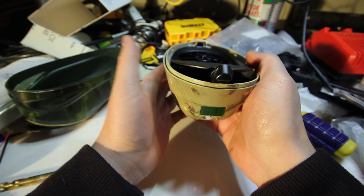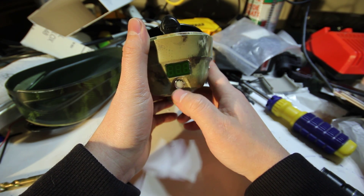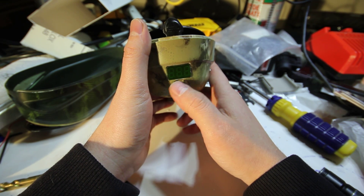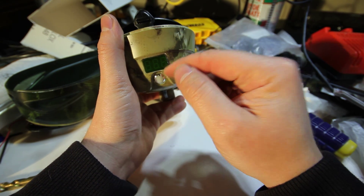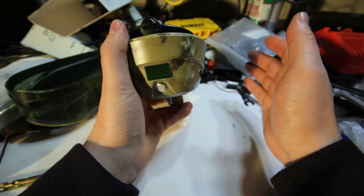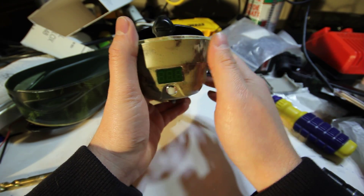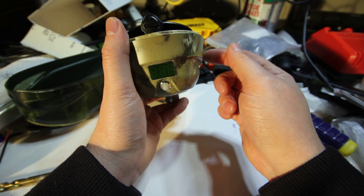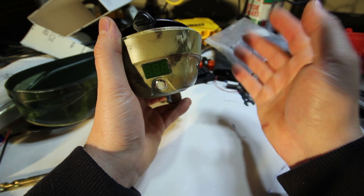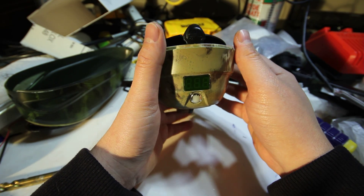The second thing I did: I ran out of batteries a couple of times. The board has a low battery indicator — this light will flash blue or green when you're running out of batteries. The problem is the board is preset for alkaline batteries, which run at about 1.65 volts per cell when fully charged and about 1 volt per cell when dying. I sometimes use rechargeable batteries — specifically low self-discharge nickel-metal hydride. If I let the hopper sit for six months in my bag, they'll still be charged. These are Panasonic Eneloop-type cells, not cheap batteries from Walmart.